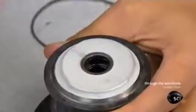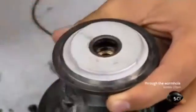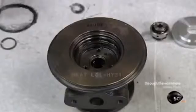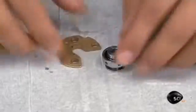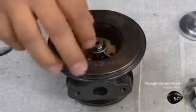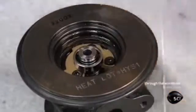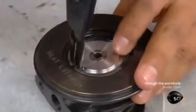It's now time to assemble all the parts. The worker inserts a bearing into one end of the iron center housing. He lubricates a second bearing and slots it into the other end. These bearings will ultimately support a shaft with a turbine on one end and a compressor on the other. He adds a metal collar and a third bearing to the assembly, then caps the bearing parts with a metal plate to keep lubricant from spilling out when the turbocharger spins.